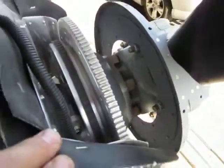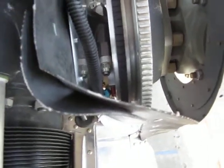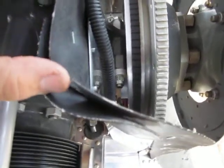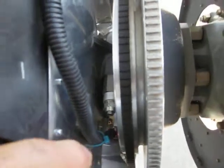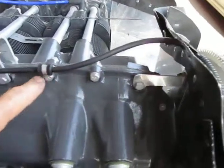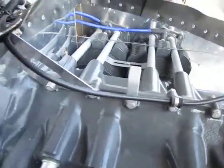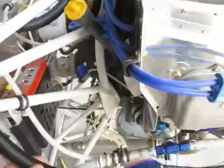The main sensor for the engine is a hall effect sensor that's plugged in at the back of the starter ring down over here. You can probably see just a bit of red down there. That picks up magnets that are embedded in the starter ring. There are two crank position magnets and one sync magnet. The important wire here is this one coming over here — secured with a tie wrap, going through the top of the engine, down through this clamp, and through the top part of the firewall, back into the engine harness going over to the EFI system.